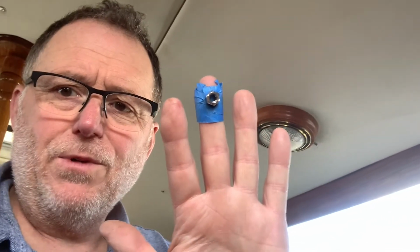So I just did a good one. I had to get a bolt right down, so if I held it in my hands like this, my hand was too fat to go through the hole, so I could only fit my hand in like that. So I put a piece of tape on the wrong way round, and I stuck the nut to my finger like that. Then I could slide it down, and then I just turned the bolt from the side that I could get to. This works very well indeed. It's probably a well-known technique. Oh yes, that's the Bloomfield technique, Desmond. Do you not know about that? No, I don't. I do now.